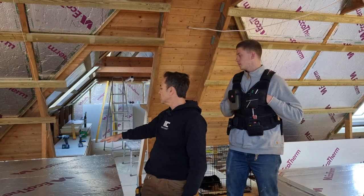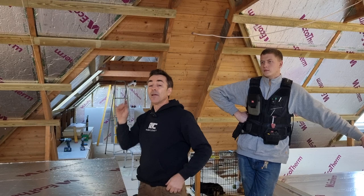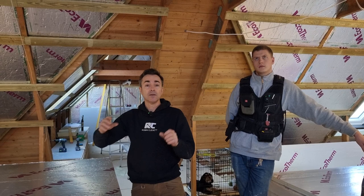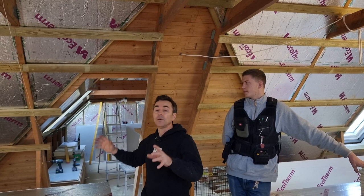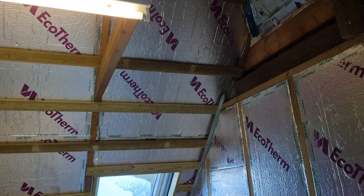What I don't like to do is come across the ceiling, up the wall, up the slope, and back down. It's much better to create a thermos flask effect where you go from the eave all the way up and all the way down. That means all of our stud work on the inside and all of our boarding on the inside is all on the warm side. Wherever we run services like pipes, they can all go in the voids — we'll still insulate them because of the heat loss from the water inside the pipes.